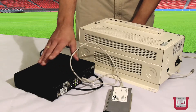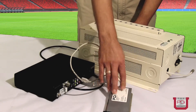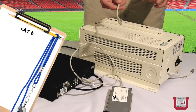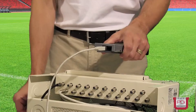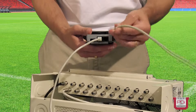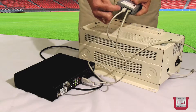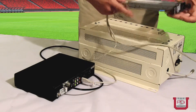Then you've got the data between the Direct TV and the interface. To get from the interface to the television, you'll run standard Cat 5, Cat 5e, or Cat 6 from your head end to each television, along with the coaxial cable. This represents the cable coming from the television — it plugs into the RJ45 port on the back of the receiver. There's only one other port and that's for service, so it's very obvious how to make the connection.